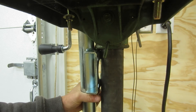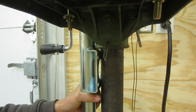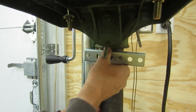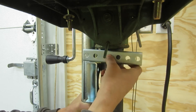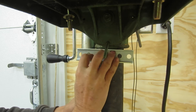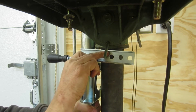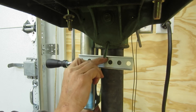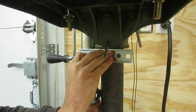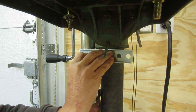The top of the jack will fit right here — I've got access to the handle and it clears the top. I'll weld in some brackets that came with the unit and may add another gusset there. This piece will actually go up and down, resting on the bottom of the tabletop, and should carry the table up and down. Let's find out if this is actually going to work.